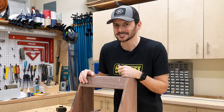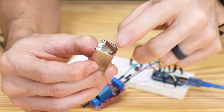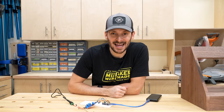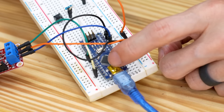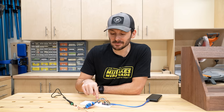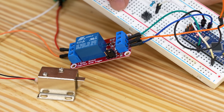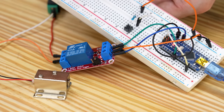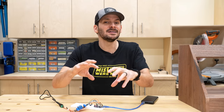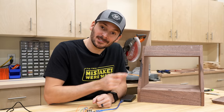Here is the base of the whole locking system that I'm starting with. My whole goal is to turn on and off this little solenoid. You can do that really easy, or you can make it really hard and have other things happen too. I'm going to be driving that off of a little Arduino Nano — a small microcontroller, which is basically just a little tiny computer that runs code. It looks for inputs and then does output. I put a little bit of code on here to say that when I push this button, send the electrical signal to this relay, which will then power up the solenoid. If I push the button, it opens for one second. You could leave it at that, but because we want a timer, LEDs, and all kinds of fun stuff, we need the microcontroller. An automated lock isn't going to do me any good unless I have a door to put it on, so I'm going to build that next.